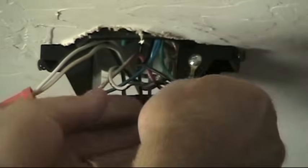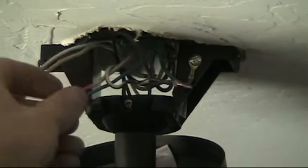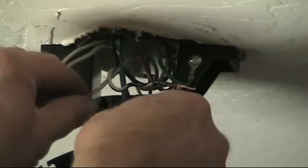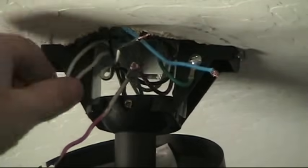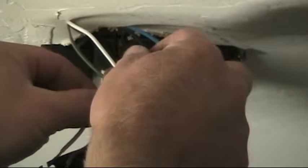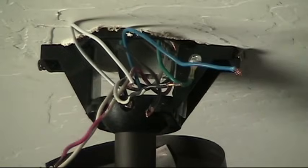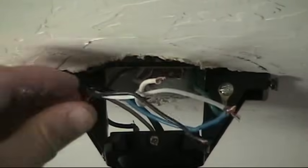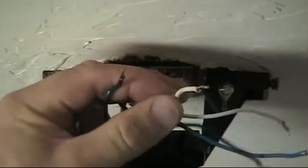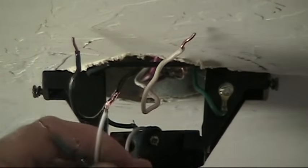As I always like to do, I remove the hot wires first. I've already checked that the breaker is off and tested to make sure we have no power up here. The fan kit blue wire and the black wire for the fan are removed, and now the neutral. Our wires are all separated — the red wire has been capped off and tucked into the top of the box. So these are the two we're going to use: our neutral and our hot from the three-wire cable. These three are the wires going to the fan.